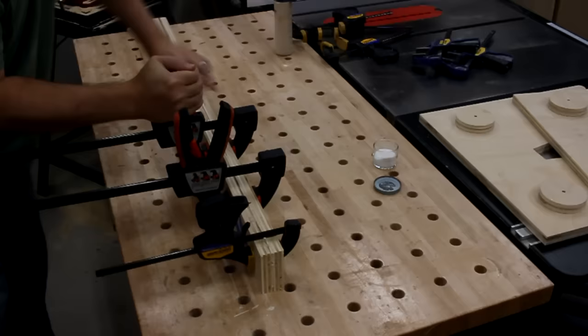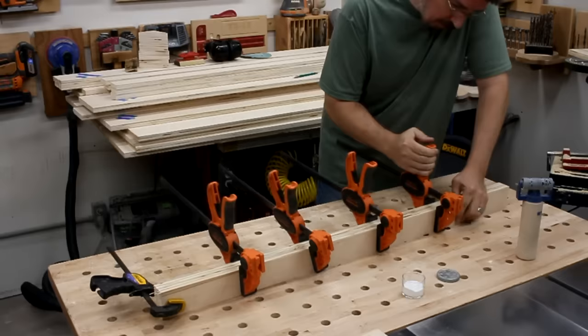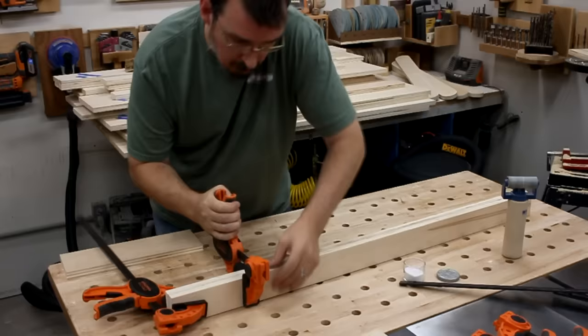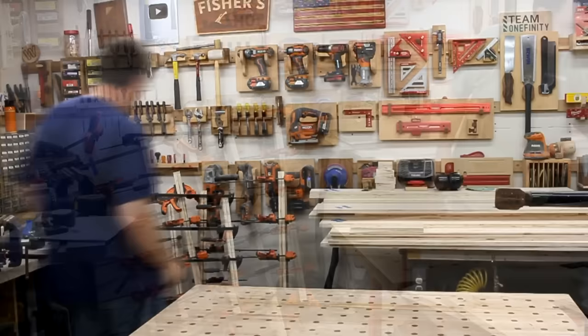The outer legs are made up of 6 pieces total, 4 legs and 2 stretchers that connect them. So I have a handful of laminations to do for them all. With everything glued up, I could leave it to dry overnight and check up on them the next morning and remove all the clamps.